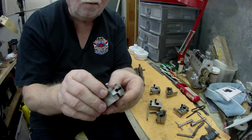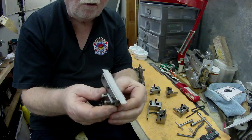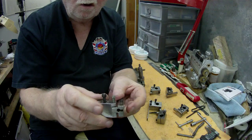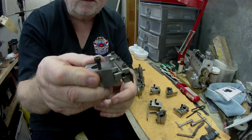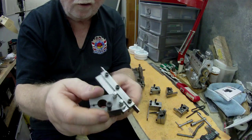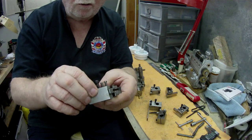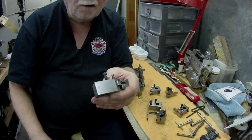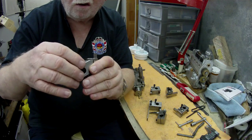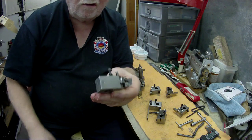Here's a holder that I had to make when I was doing the radiator machining. I bought another parting off tool and made up this adapter to hold them in one of my holders. The height is all adjustable. It's very simple — I would like to have got screws with nylon inserts in them. But there's nothing wrong, they worked perfectly.